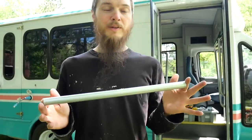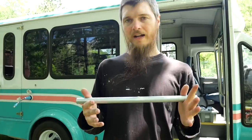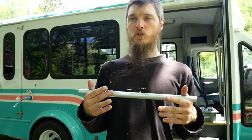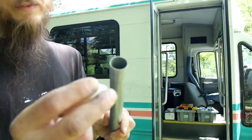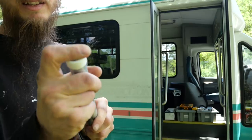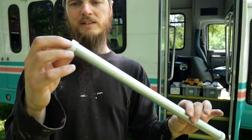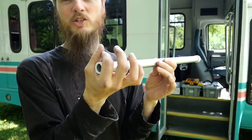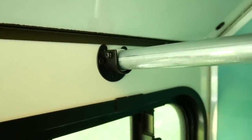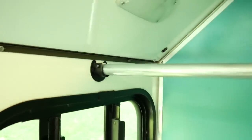I'm going to be making our curtain rods out of three-quarter inch conduit — it was honestly just the best option I could find as far as cost and strength. Super rigid and cheap. I looked at a lot of curtain rods online and I couldn't believe the prices — they were just outrageous. I cut my first piece, and to finish off this conduit I'm going to be putting these little bushing caps on the ends. It puts a protective edge on it and puts this plastic in our brackets so it's not metal to metal chattering around. You can see those plastic things — they actually make these conduit rods fit perfectly in these one-inch hangers. Perfect fit and no rattle.